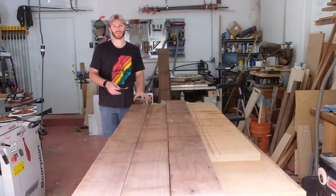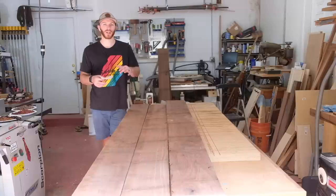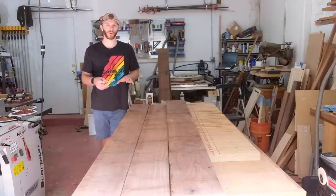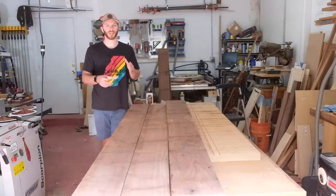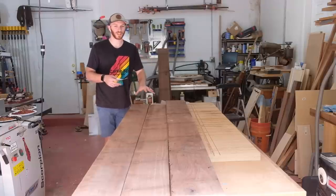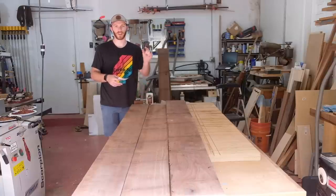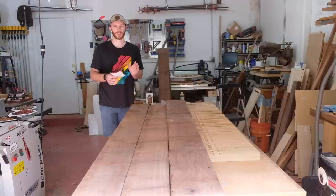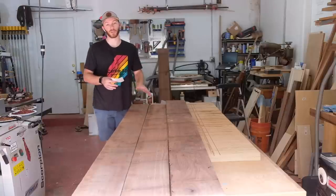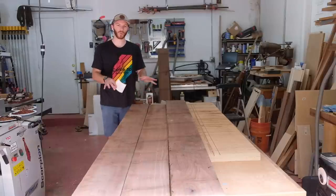I always like to buy as thick a piece of lumber as I can. That's usually eight quarter, sometimes six quarter. I rarely want to use four quarter because there's just a lot of waste involved unless you need something that's close to seven eighths of an inch thick. These ended up being five quarter boards. I don't know if that's going to be the best yield because my casework is five eighths and I have some three eighths inch dividers, so I should be able to resaw and get what I need. But if not, I have some extra material — and that's another point: always buy extra. I ended up buying three sticks that are 13 feet long, which should be more than enough lumber for this specific project.